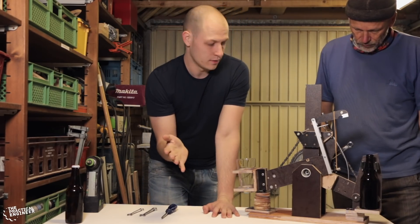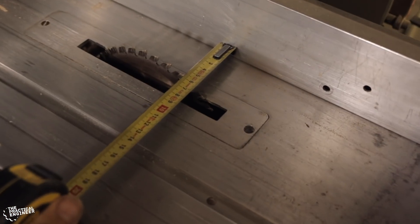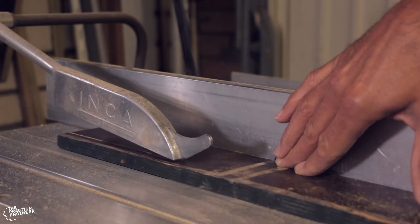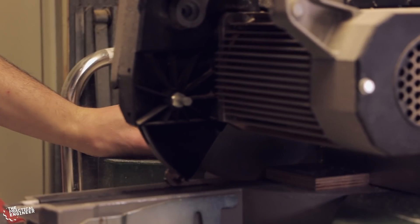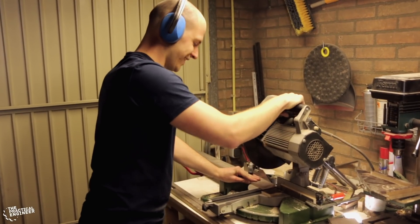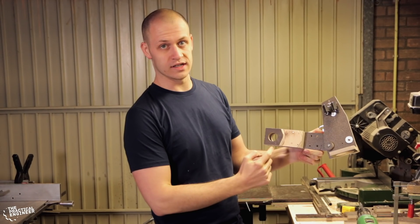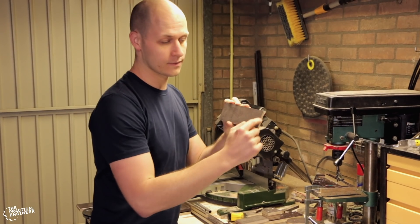So we need to take this apart to build a new one. We cut all the wood for the arms. Next, we need to make these holes and we're going to make a nice radius to it. I start by drilling a center hole in the piece so I can align the work on the router table when I'm cutting the radius.